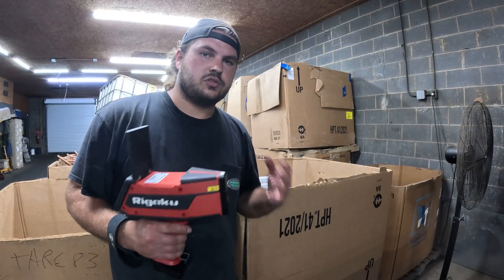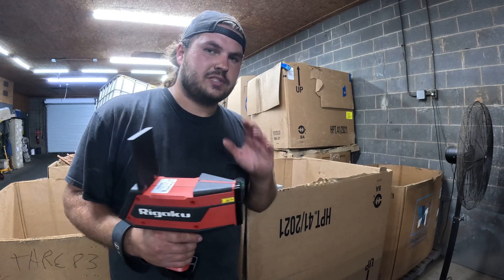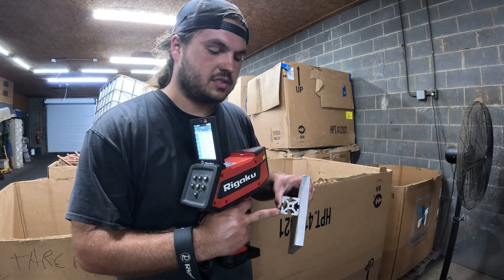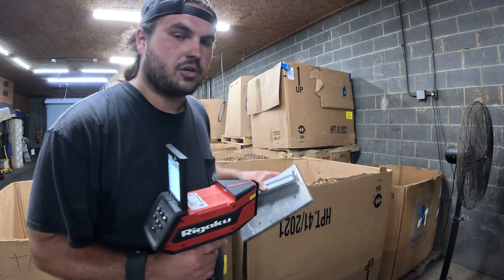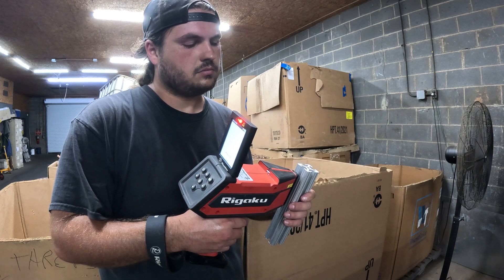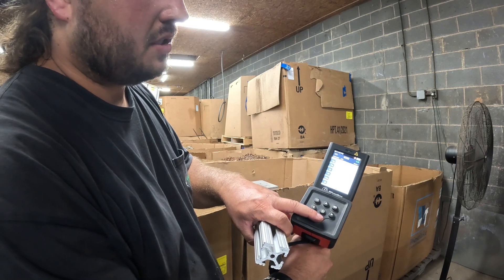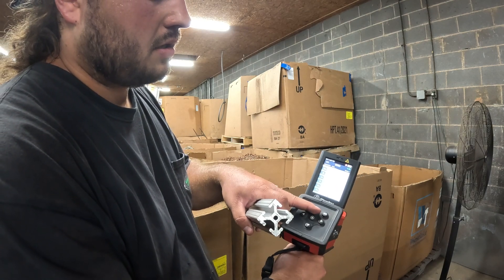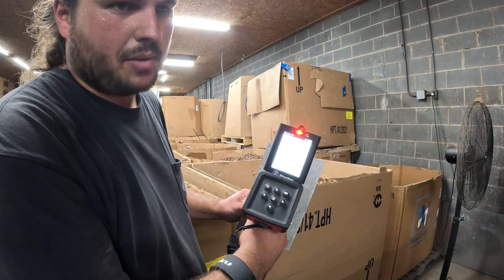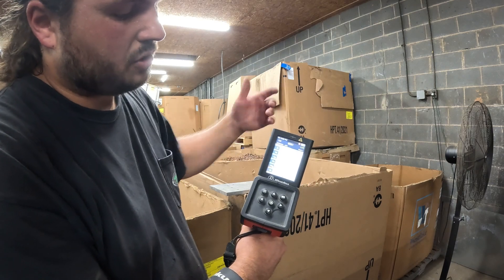Most commonly we use this analyzer to sort aluminums by alloy. Extrusion aluminum can often be told apart based on other attributes without analyzing it. Right here I've got two pieces of aluminum — sorting by shape, we'd know this one is 6063 and this one is most likely 6061. But let's go ahead and analyze them to make sure. I haven't prepped any of these surfaces, so if we get a slightly funky reading, that's why. And we got 6063 on the first piece and 6061 on the second — which I pretty much already knew.